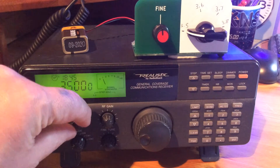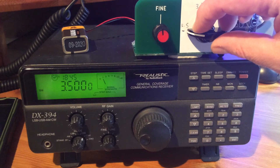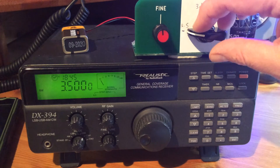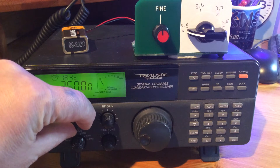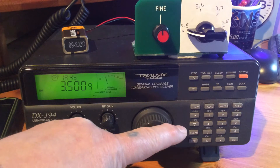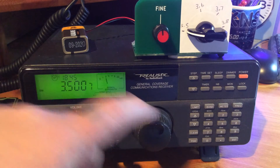That's why I've set it at 3.8 — you'd have to be careful not to go out of band. So I'll give you a bit of a demonstration now. If we turn it up — it's very very sensitive to heat — there we go. I've actually tuned in the fine tuner as well. There we go, 3.5 for zero beat, and if we go up...